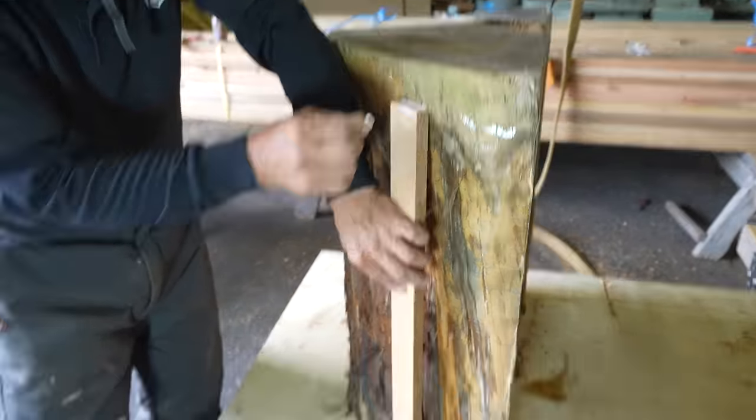The legs were too big. I think cutting about 4 to 5 centimeters would be an ideal balance. This small chainsaw's chain is blunt. When the chain is not sharp enough, the wood shavings look like sawdust. The finer the shavings, the less effective the saw. I'll sharpen the chain later.